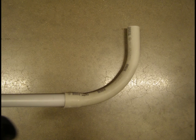If you wanted a sink, you have to jackhammer down at least 8 inches without disturbing the post tension cable.